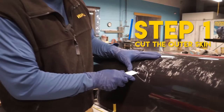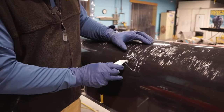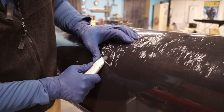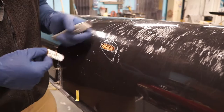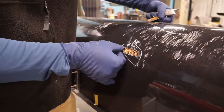We're going to cut into the boat on a very sharp angle, cutting through the outer skin and not through the inner skin. If I went straight in, I would go right through this skin, through the honeycomb, and through the inner skin. So we're going to be on a nice angle. Push in through the skin, rock the knife over — remember, this is unidirectional carbon, it's not real easy to cut. Roll the knife up, and there we have it. There's our honeycomb.